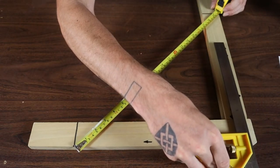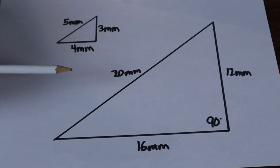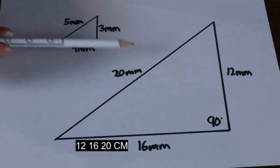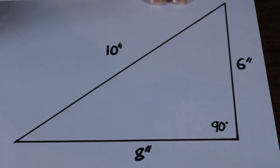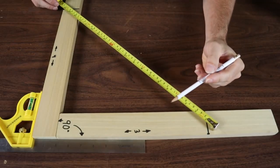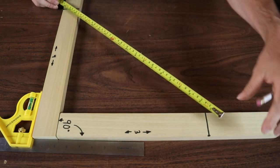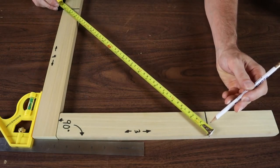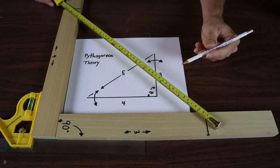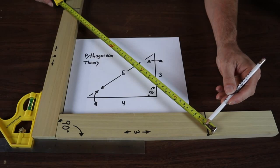This works in both metric and imperial. You can also multiply out: 6-8-10 or 12-16-20 — that corner will be 90 degrees. If 3-4-5 is too small for a bigger corner, go 6-8-10 or multiply however you need. The key is to move the sides back and forth: once you've got your 3 marked and your 4 marked, move the sides until the hypotenuse is 5. If you're figuring this out for the first time, do it on paper first like these diagrams show — that's really the key.